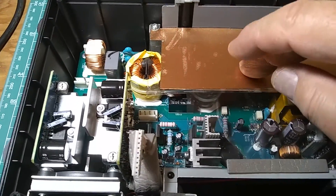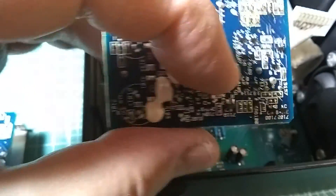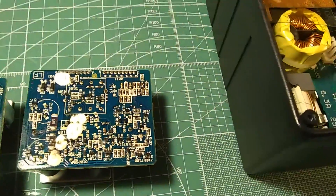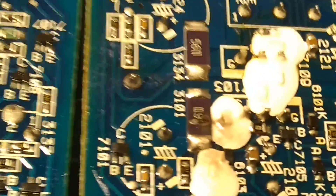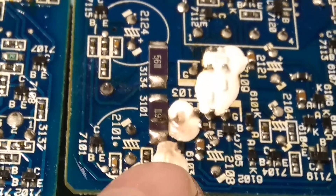I'm going to dig deeper. This is the power supply section right here under the screen, so I'm going to open it up and see what's going on. I have removed the two amplifiers from this area. The way they are attached is with a couple of sockets and a single Phillips number two screw that holds it in the console. When I look at the printed circuit board I can see right away that one of the amplifiers has a problem — there is a burned SMD resistor right here.